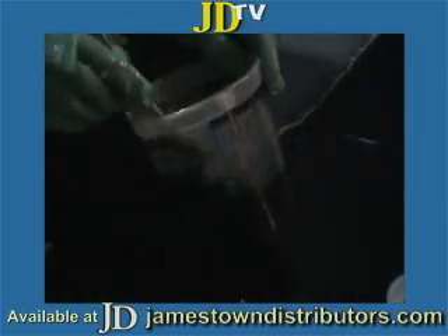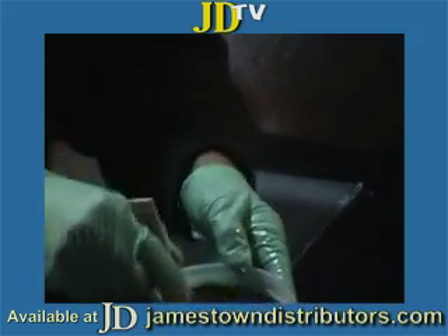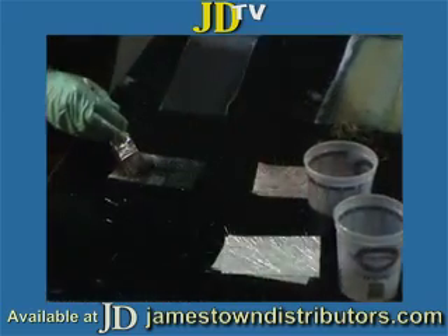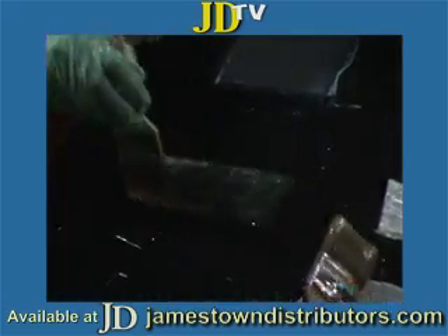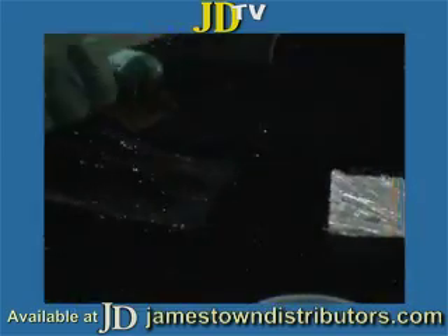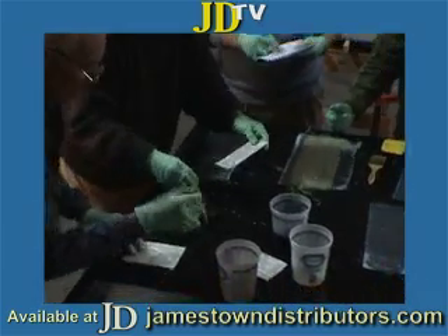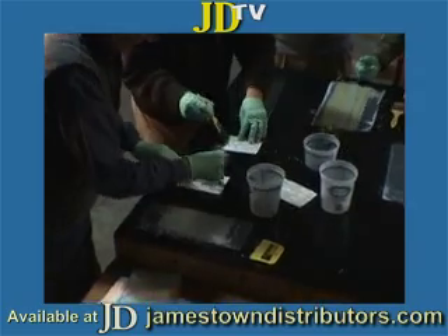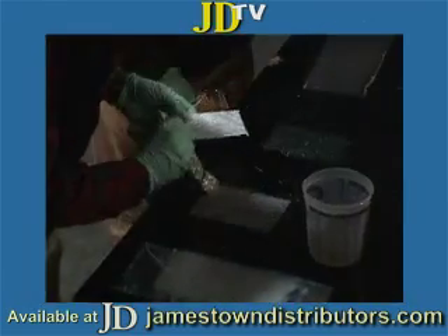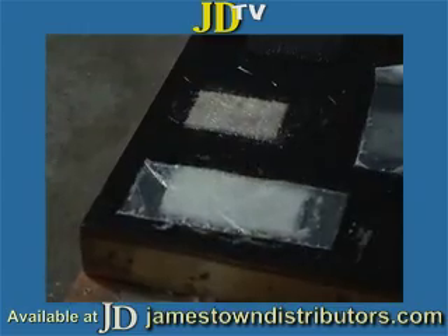This is actually an infusion resin that we have in the shop — it's very, very thin as you can see, and it's a vinyl ester blend. What we can do is take the epoxy and do the exact same thing I've done with the mat, just wet that out and do it side by side. You can see how the mat just really disappears with styrene-based resins — it's just really, really clear. The binder that's holding the mat together is designed to dissolve in styrene. The good news and the problem is that epoxy has no styrene in it. So doing these side by side, you'll really see how one just wets right out and the other one doesn't — it looks like it's dry, but it's not. There's plenty of resin; it's just not breaking down the binder.